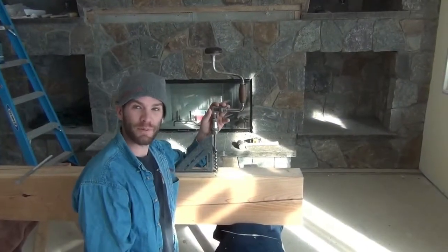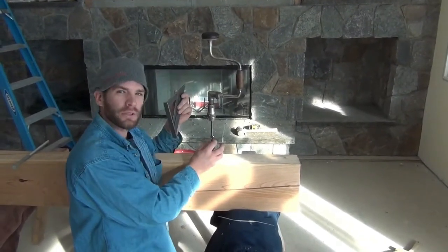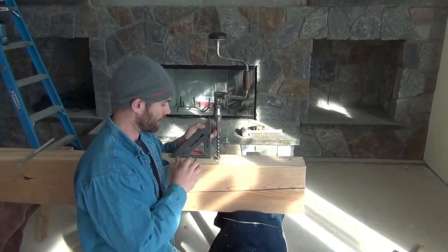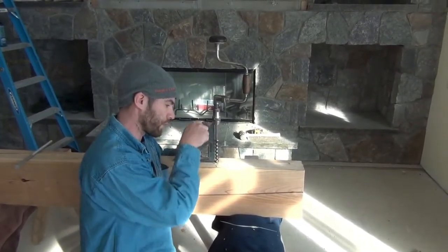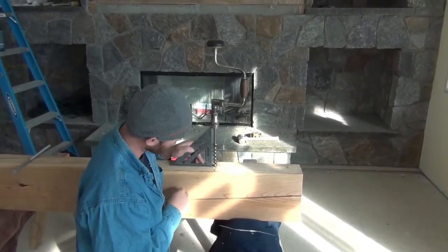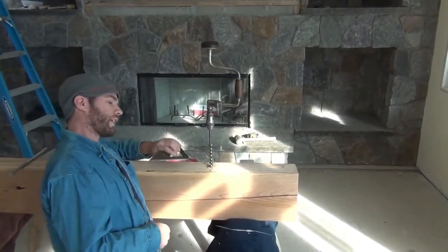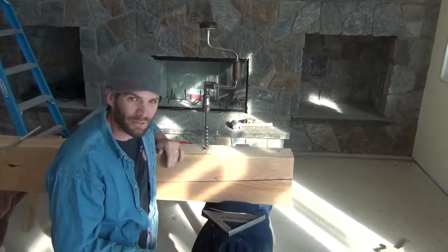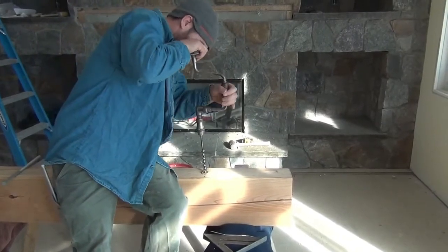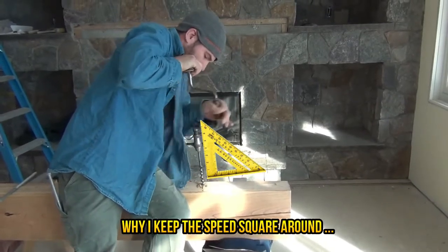How often do you get to use grandpa's old bracing bit? We took about an eighth-inch larger bit than the rod we have, because that gives us a little bit of play if there's any inaccuracy. But still, it's really important to make sure you've drilled this thing in as perfectly straight as possible. So I keep a speed square nearby, just keeping an eye that I have this straight and this straight. Keep an eye as you're going along — you don't have to do it with a bracing bit, you can use modern technology — but this is the process: getting a nice straight hole in the back of your mantle piece.